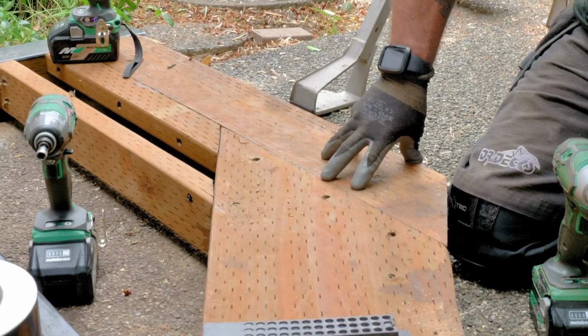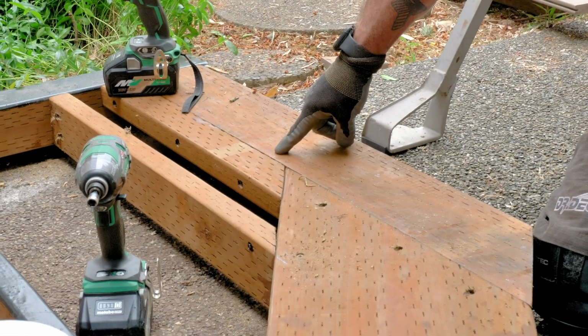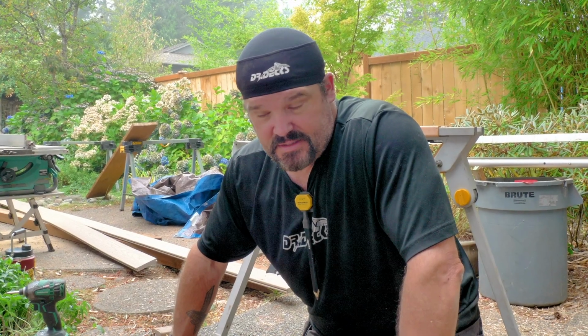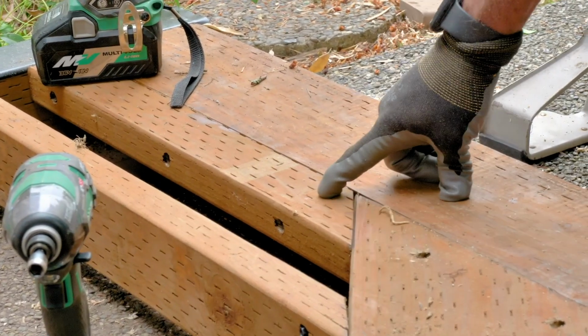All right, so getting a little thick over here, but I have an outside rim joist that's a 4x6. But a 4x6 isn't quite wide enough to accommodate my flat surface border plus the field decking that I need to screw right next to it. It's kind of thin. It would put all my screws right close to the edge of this 4x6, and when you have a row of screws like that, it's not the greatest. We're Cortexing this deck because there are no groove boards available for several weeks because of COVID. So we ordered a solid plank and we're going to Cortex the whole deck just by face screwing and Cortexing it. So I added a 2.5-inch cleat to this 4x6, so I have a good place to install my screws for my field decking, okay?